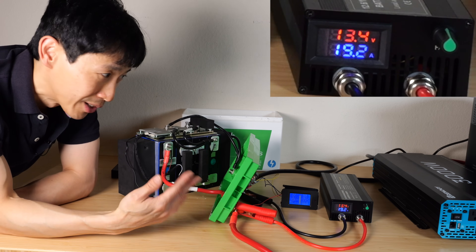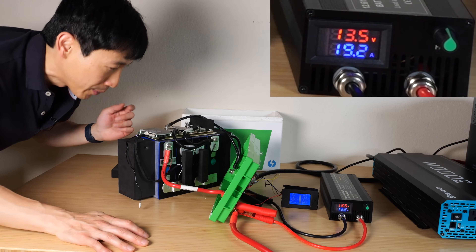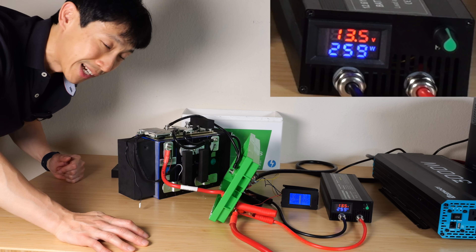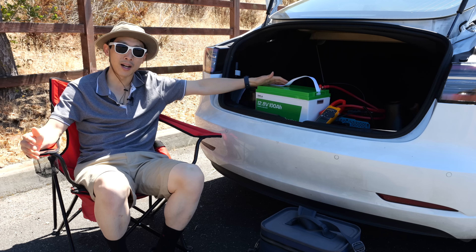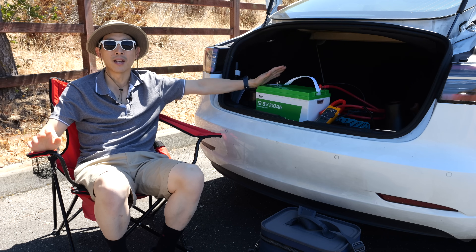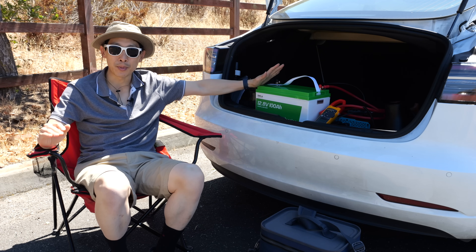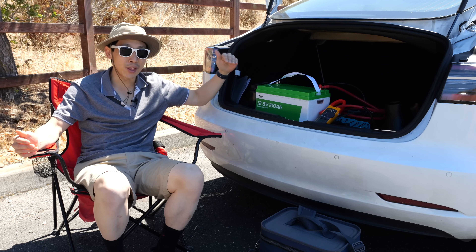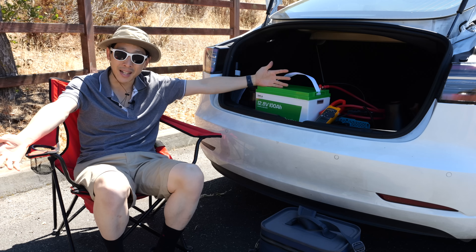So if I ran it really hard — at 150 amps, 200 amps or so — we might be able to get the temperature high enough to make it cut off. Usually batteries of this size do not support trolling motors or large inductive loads. Officially it has a 100 amp BMS, but it doesn't really cut off based on current — it cuts off based on the temperature of the internal BMS. Based on my previous tests, I ran it 30% over capacity, which is 130 amps or so, and it ran for minutes.